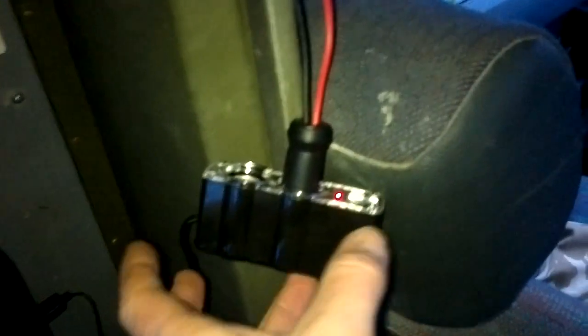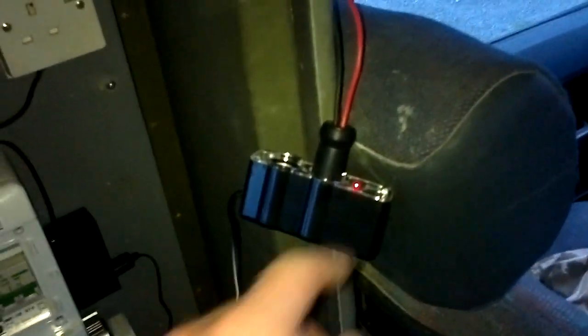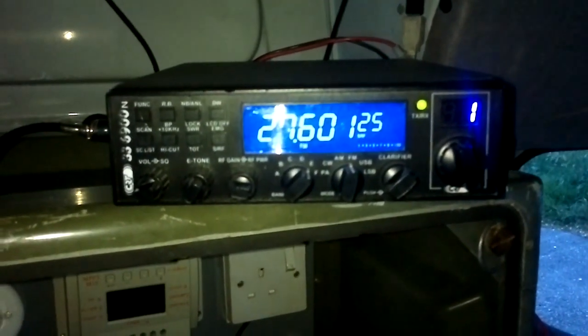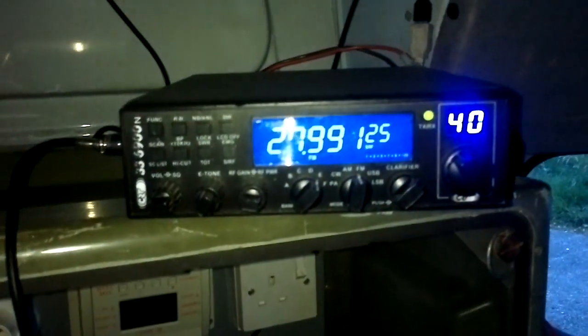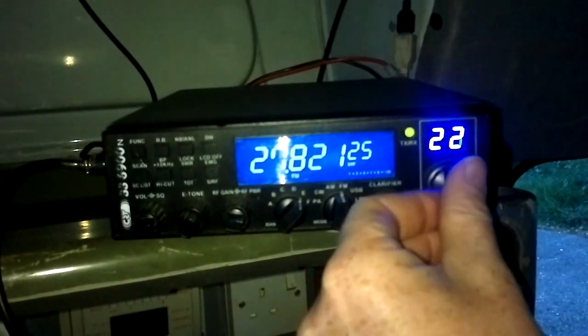Getting all the stuff out of stores today I did have a new power lead in a packet and I'm glad I picked it up because the other one I left in the small go box. It's only a cheap one so I'll probably just blow the fuse - it does have a fuse in it. The lead for the radio doesn't actually reach the socket in there. Checked the SWR and it's bad, so I've got to recheck that. I haven't got an allen key with me so I can't adjust the top of the fire stick. It is working though - I'm hearing skip, probably France. 1.8, then 2.4, so not the best SWR but it's working.